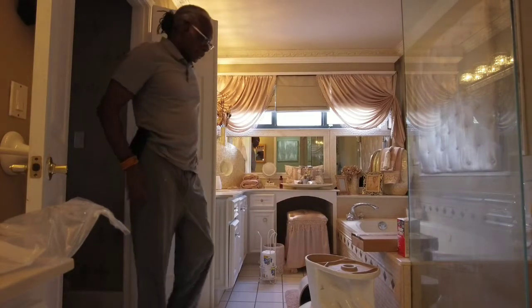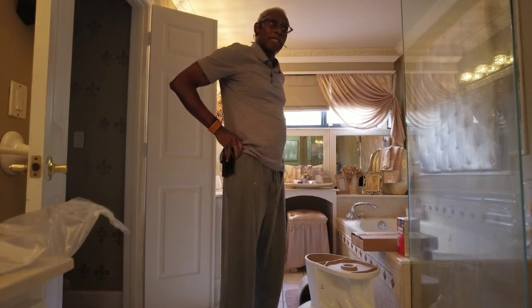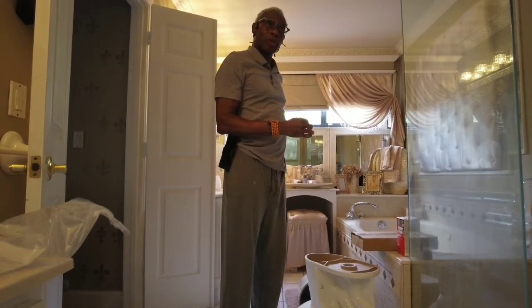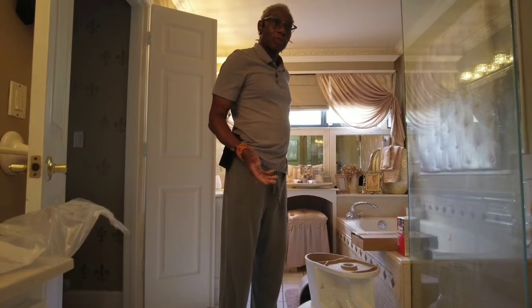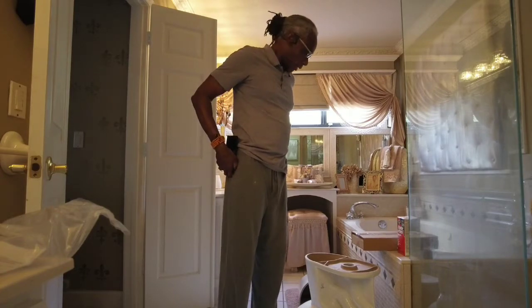it turned out that you didn't need a refill tube. The ball cock had the branch for the refill tube. The Douglas valve had the little hook spot where you would push the refill tube through. And yet you didn't need a refill tube. No water came through that. And I didn't find that out until after I bought another ball cock myself and utilized that refill tube.